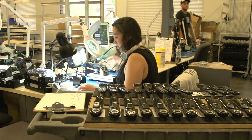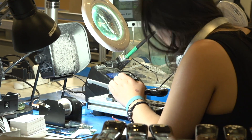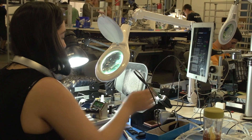When bonding is done and the arm comes out of the oven and we clean up the arm, it's time to add the electronics and the housing. Adding the electronics involves soldering all the wires. However, this step involves a lot more than just soldering — we want to test the strain gauge, we want to test connectivity with Bluetooth, and we want to test the temperature sensor.